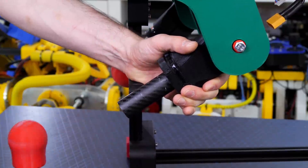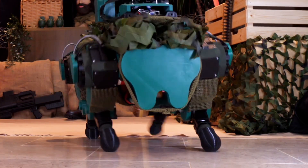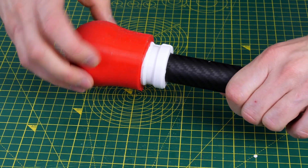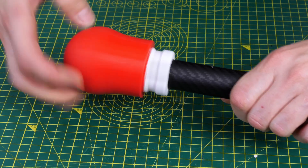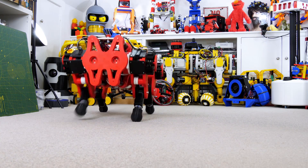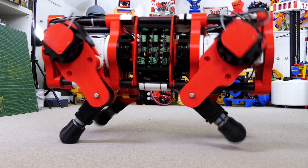They didn't get much use though, because I changed them for black pigmented versions for a Battlefield promo, and I still had quite a few issues at first where it looked like it was just slipping on ice — something really weird was happening. It turned out the rigid insert is much easier to rotate on the tube even with a zip tie around the collar, so I ended up super gluing them on. The carbon fibre tube is glued into the bottom of the leg as well as onto the foot, so now we're stuck with black feet with grey inserts until I reprint the whole bottom of the leg, in which case we can have the red ones back.